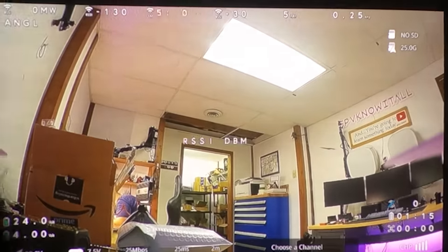There's one other thing I have to mention regarding image quality. The right-hand optics on my goggle have two large pieces of dust or debris inside them — not on the eyepiece where I could wipe them away, but inside. You can clearly tell because they go in and out of focus as you adjust the focus, and one of them moves as you do — it's on the moving lens element. There is no other way to see this other than as a manufacturing defect. If I were a customer, I'd expect SkyZone to exchange these goggles.